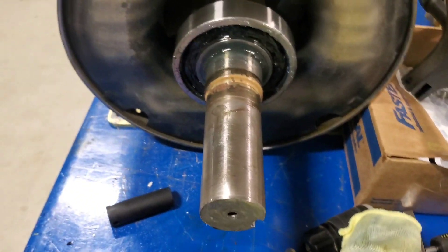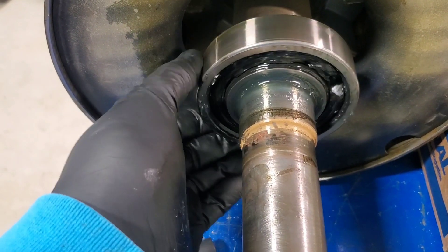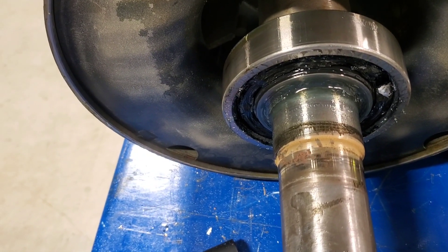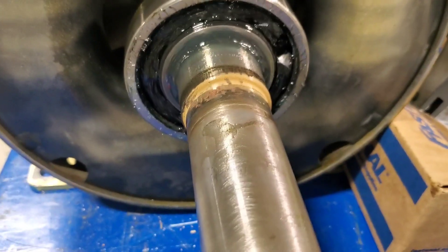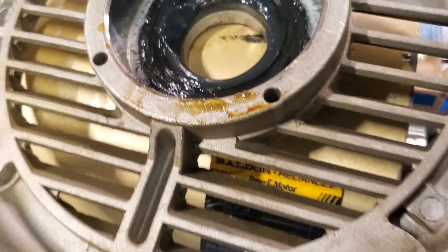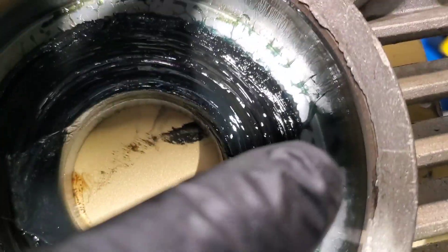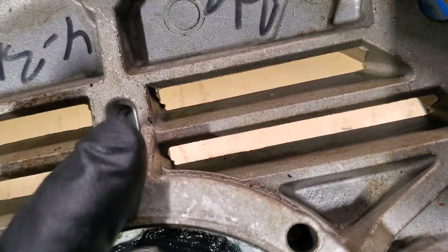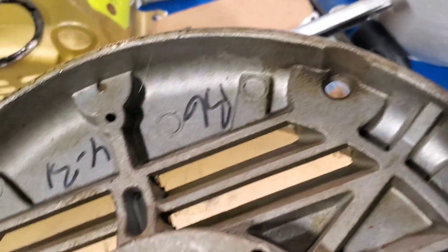Hey there boys and girls, fellow mechanics. I'm a YouTuber and I've got this motor back in the shop. It has less than a year on it and it came back from a motor rebuild shop. I'm going to rebearing it myself this time. The big problem we have here is over-greasing, and yes you can over-grease a bearing. It's got a funky smell and you can see right here there are signs of drying and caking. It's all gone hard — it smells burnt.